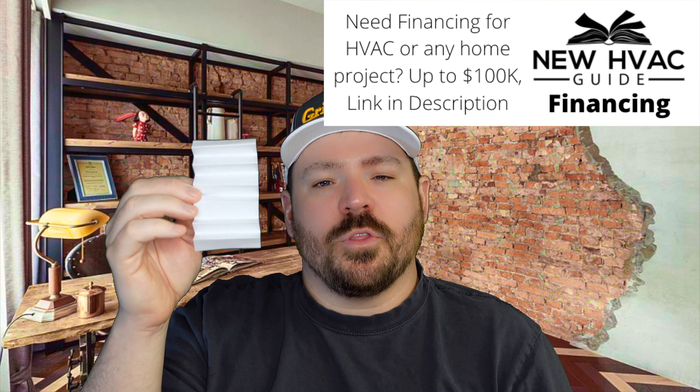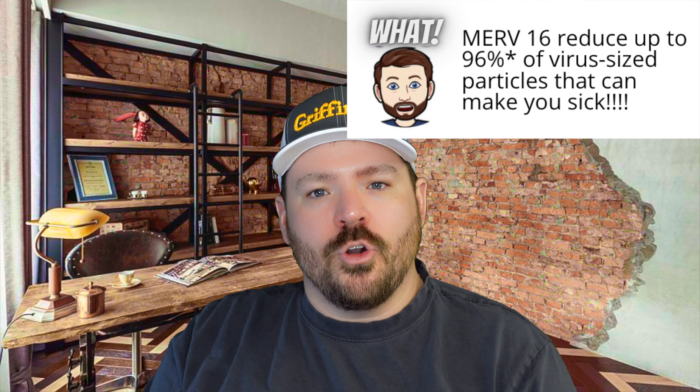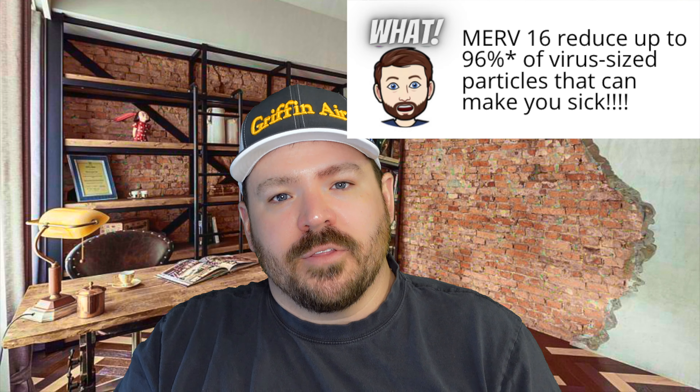If you're spending five to fifteen dollars a month on disposable filters and you replace them with a whole house home filter that needs replacing once a year at about 30 or 40 bucks for the media, when you do the math these end up costing more long-term. The fact that you wouldn't consider it because of cost is just silly — after a year, the whole house filter is way more superior for cost savings. Also the MERV ratings are so much higher on these whole house filters, cleaning the air in your home way better than disposable filters.